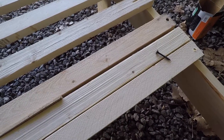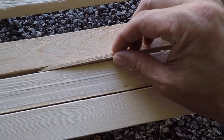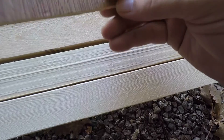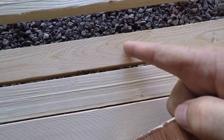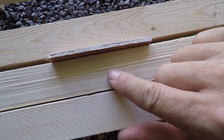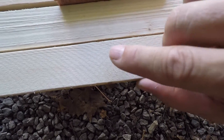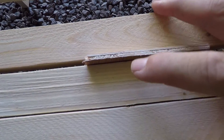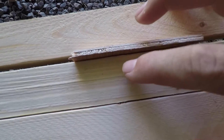Here's a couple things I'm learning as I go through this process. I'm using about a 3/16 inch shim — just a piece of laminate underlayment I had laying around. I put that between the board that's solidly mounted and another board that's going to be the one that slides in and out. The board I'm mounting goes up tight against that, so the gap will be half the width of the shim on both sides of that center board, so it has room to slide back and forth.